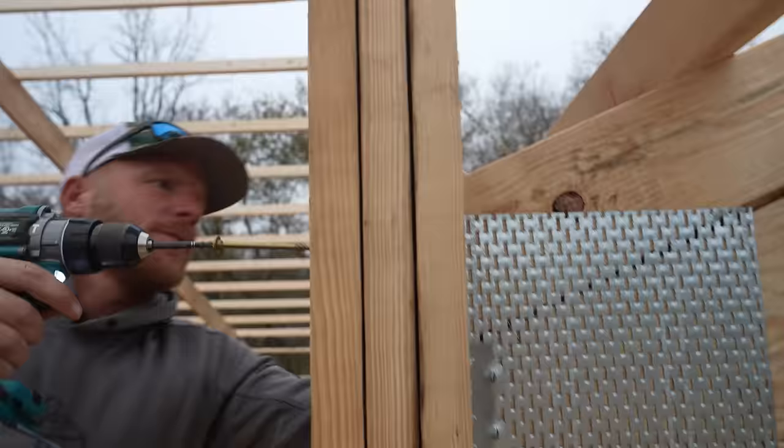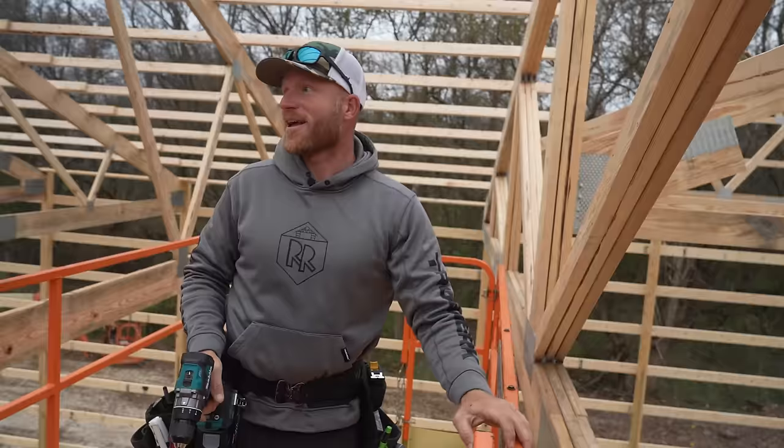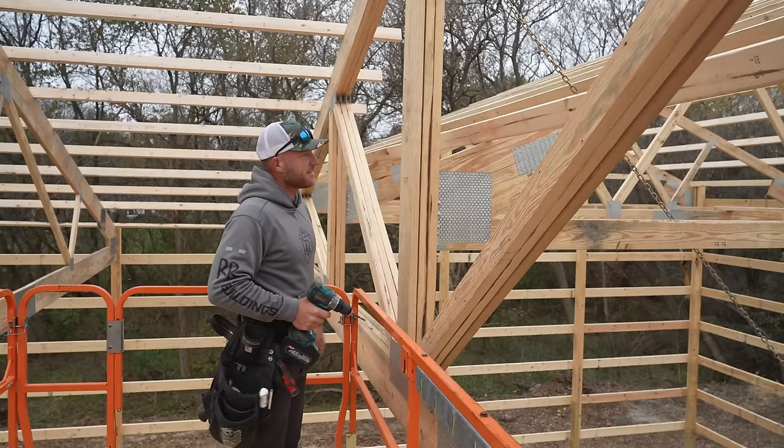Okay, ready, Greg? Oh, boy. Dude, not only did it suck the truss in, but it also crushed this center ply. So we're just doing that on each of these, making sure that everything is as tight as possible, because this 4.5-inch dimension was figured into the building. Therefore, if it's not 4.5, it could be spreading out the interior width or length of the building.